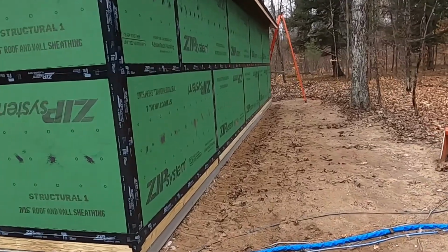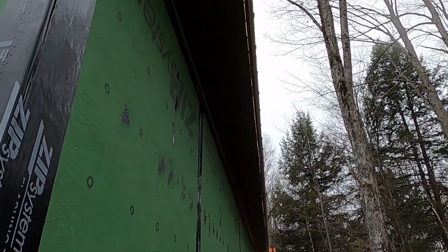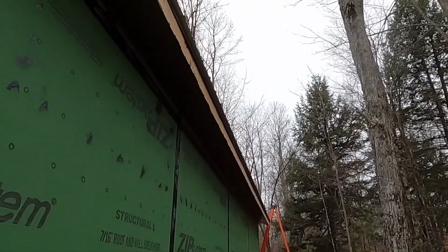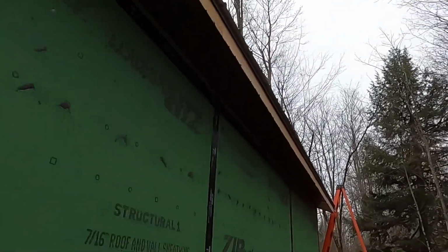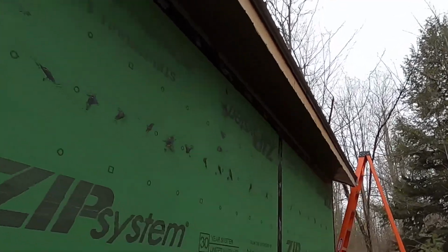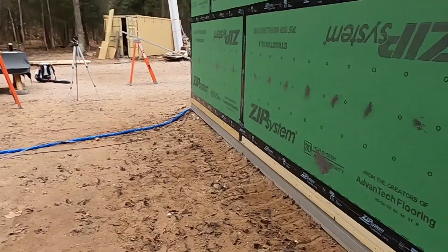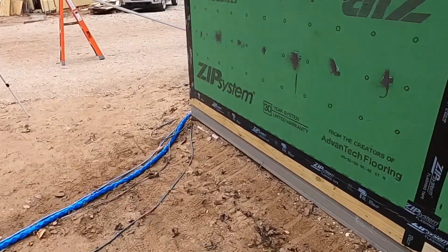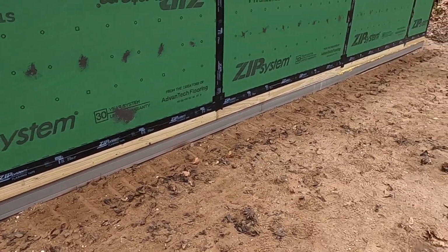Robert started off blowing some leaves out of here. We finished the soffit under the eave here, and some of the panels are longer than others, and they're hanging out over the fascia board more than we want. So he's going to grab the grinder, and he'll go along the edge here, grinding off the bits that are offensively overhanging. The reason he raked is we have a magnetic sweeper that we hope to bring over this area after the fact and grab the shavings that fell.